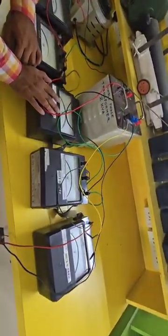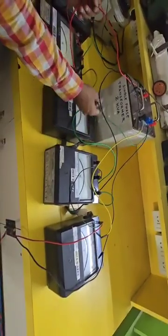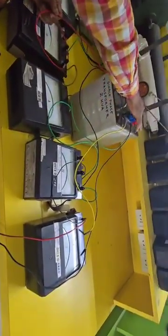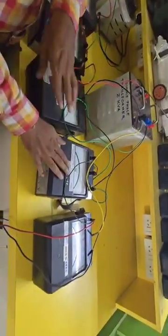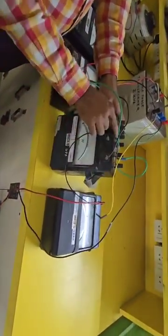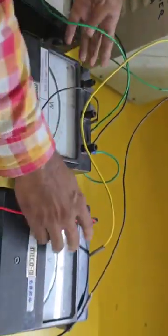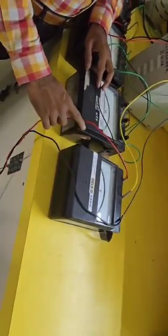Now we come to the secondary connections. It all starts with the ammeter. Here you can see the ammeter — there are two blue-green connections. The beginning, which is extreme left, is connected to 115 as per the circuit. After that, the second terminal goes to M. As like the primary, it goes to M, and here MC are being short-circuited. From this, the L terminal is connected to the voltmeter.